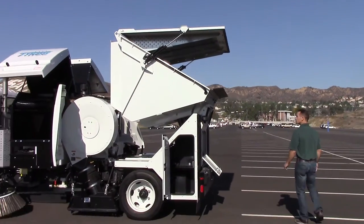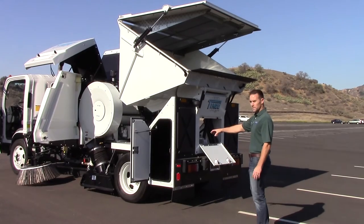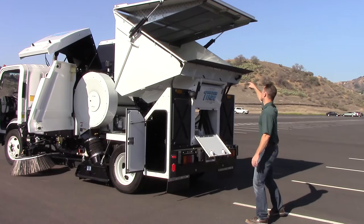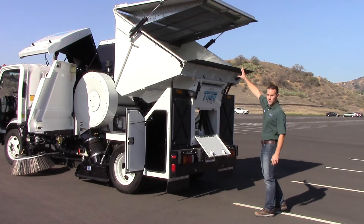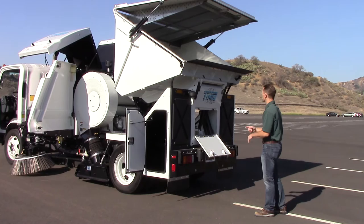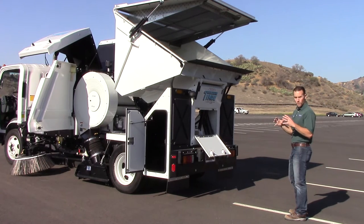The blower wheel is pressurizing the pickup head and air blasting the pavement. It goes up the suction tube and comes up the chute into the hopper. All the heavy solids fall to the bottom. All the fine stuff we pull up through this screen and through our dust separator, and then back down into the pickup head, air blast the pavement — we just do that over and over again. We're regenerating the air — cleaning and reusing the same ball of air over and over again.